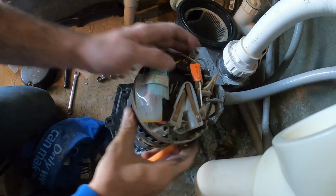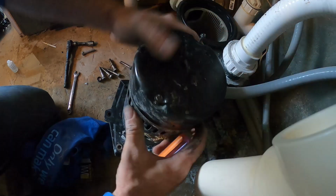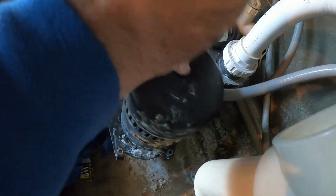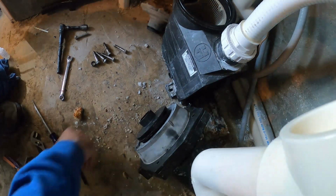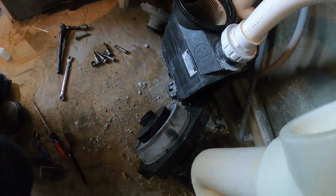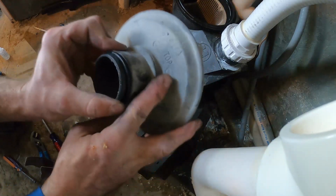And there she is. From that point, I like to put my cap back on here. So that's all done. Once again, that's just this 1/4" driver. So with our impeller on, motor's all cleaned up, that cap's all put on. Then we'll go ahead and put the rest of it together. That goes on over top your impeller, and your diffuser will say top.